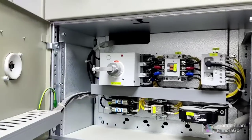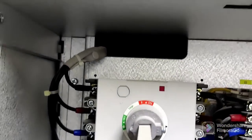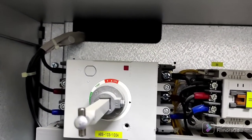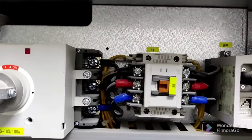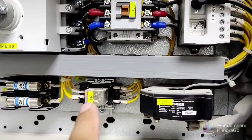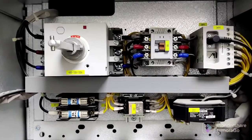We are working here. Open and look at the circuit — we have a main MCB, correct ABS rating is 100 amps. For safety purposes it's in the on position; it can also be in the trip position — you can push to trip. This is the contactor rated at 88 amps. This is the EMPR — Electronic Motor Protection Relay — connected here. This is a CT, and there are two fuses of two amps for safety purposes. You can see this is a simple circuit for that motor.